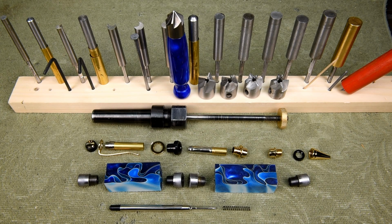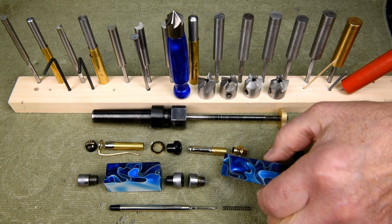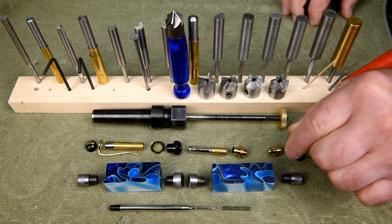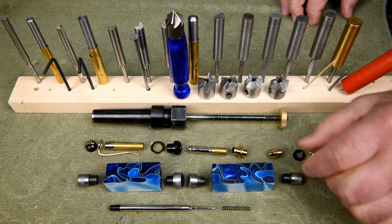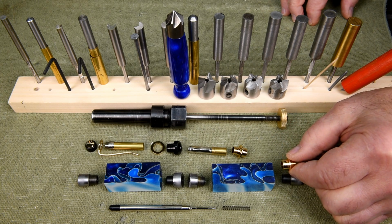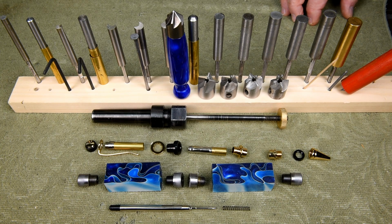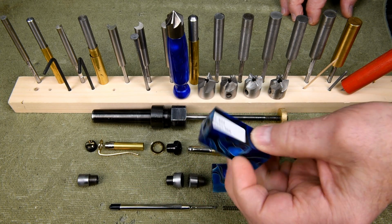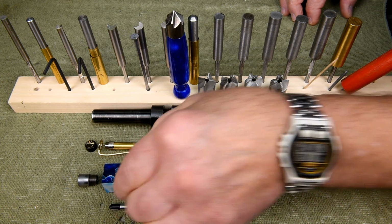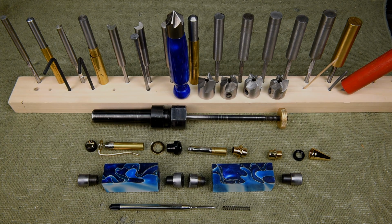It is the next morning, and clearly before we can get these bushings to go into the ends, I've got to clean it out. And also before I try to press the parts in, it has to be squeaky clean. No residue of any kind that's going to cause the part to bind as it's being pressed in. And I guess that's going to be the next step now, is get these cleaned out. And like I say, it's very important to do a good job. So that's what I'm going to do. A good job.